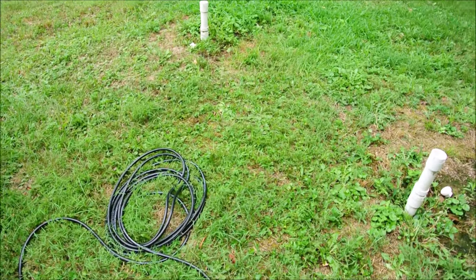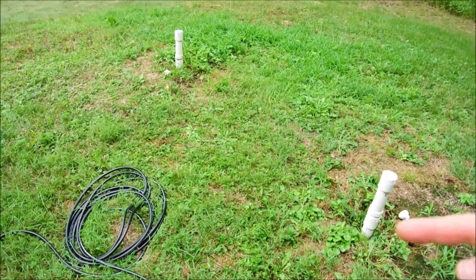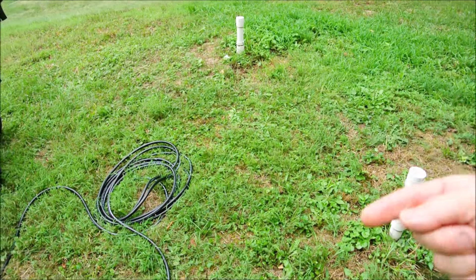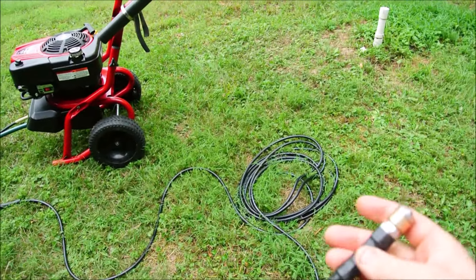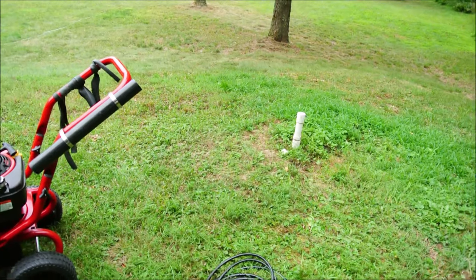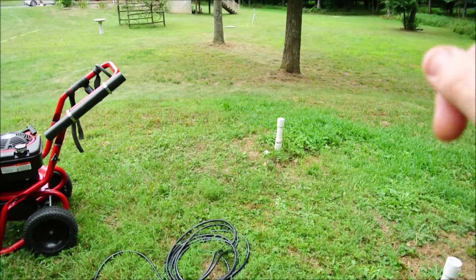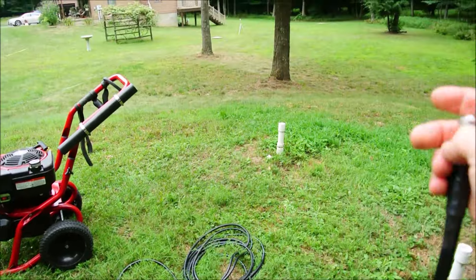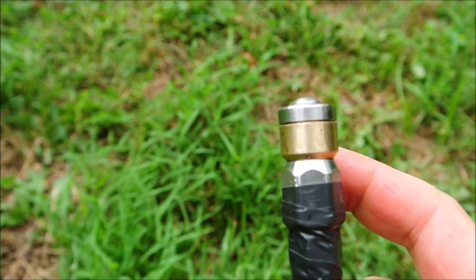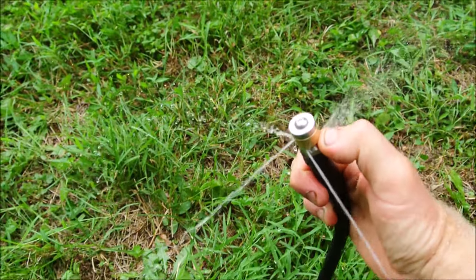Because it shoots backwards, it kind of propels the nozzle forward and digs its way through. The biggest problem seemed to be getting it to drain out quickly enough — because it's shooting water behind it, it won't let it drain through and flush the system, and I don't think these nozzles work under water. The collection screen had nothing in it — I think that's because there isn't enough flow in a garden hose to flush it out. Next I'll flush out all four with the rotating fitting — it rotates as you put water through it.